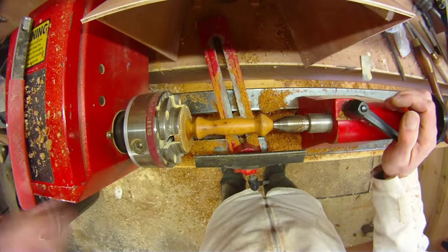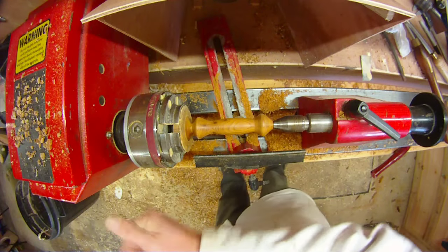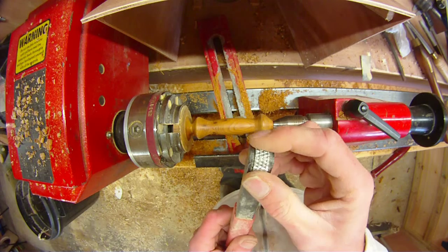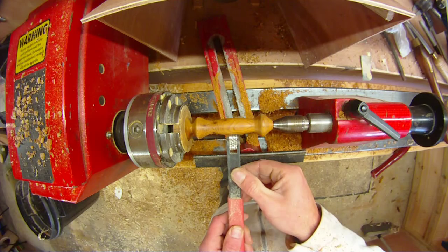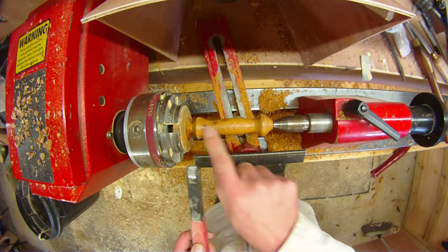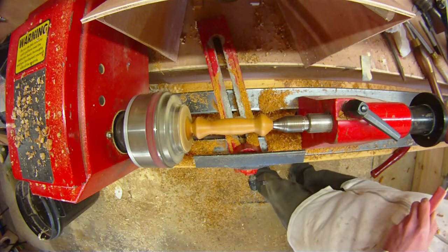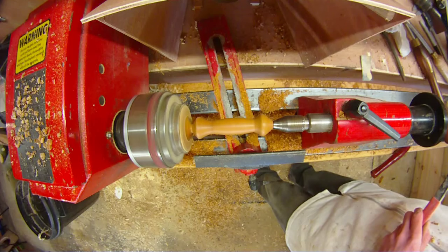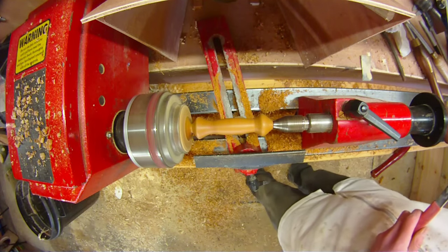Done. Right, we've sanded down to 600 grit now, all around the piece. And I'm going to take the knurling texturing tool, and then starting in the middle of the handle, I'm going to add a bit of a grip, and then move out either side of the middle to ensure that it's even along the piece, if that makes sense. I'm going to turn the lathe speed down.